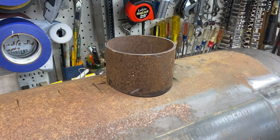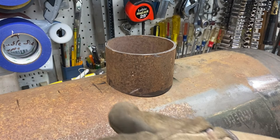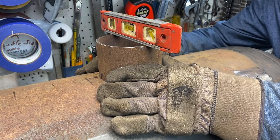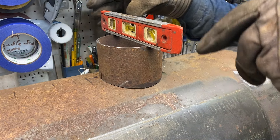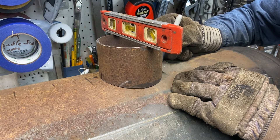These bottom bungs are not entirely level with the top ones, so the dome is going to have to come off center just a smidge. We can find our top by putting a level on it and sliding it around until we're happy. I used the bottom end plugs as references for where the bottom of the tank car should be. However, I noticed that drawing a line through the center of one down the tank car wouldn't end up in the center of the other plug — they were clocked slightly off of one another, so I split the difference. That helps me find a bottom so I know where to put the dome on top. There's our true top — we've got a level on here and this is where we want it to sit, so I'm going to re-establish my witness marks.